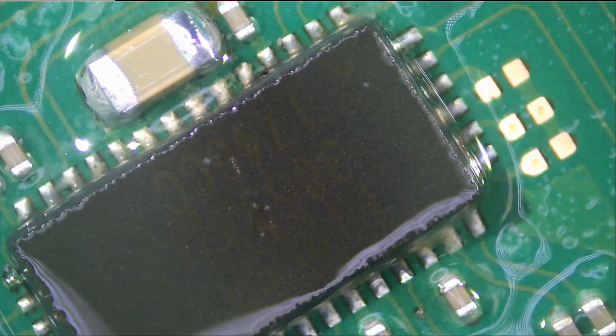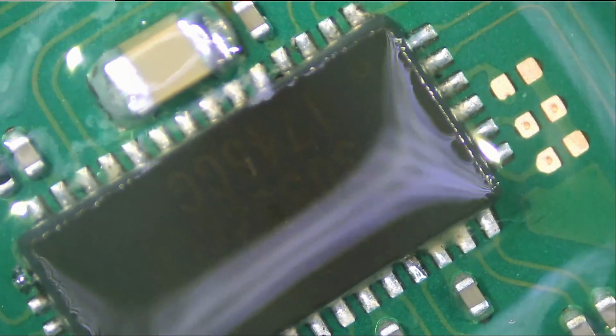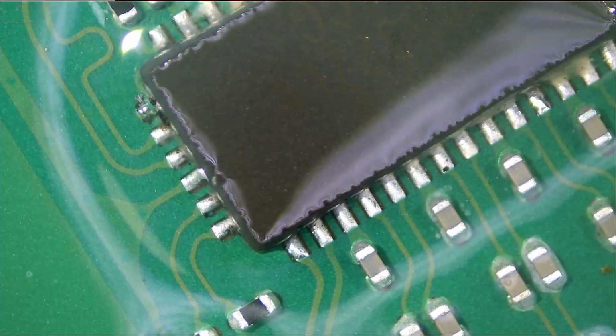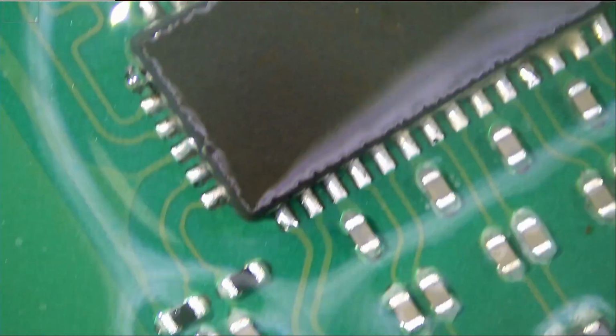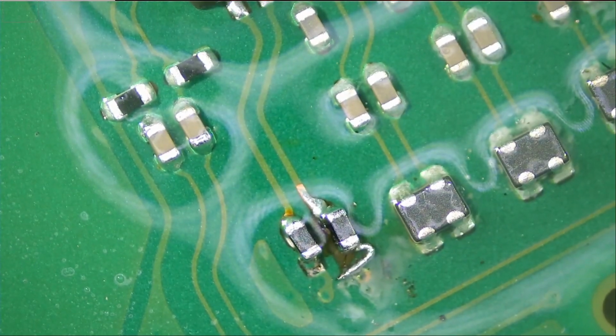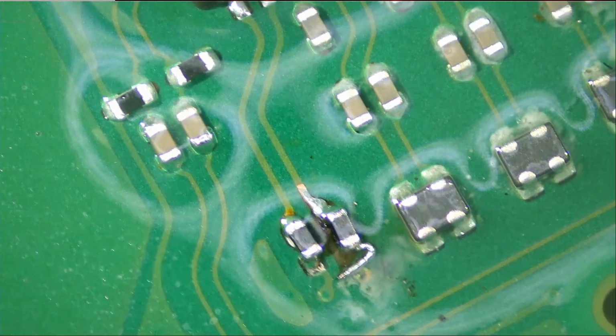Okay, so we're gonna give this to Big Boss to reassemble, and hopefully this Nintendo Switch will work. We fixed the charging circuit by changing the IC and the filter, and now we changed the back chip here, which is responsible for image, and we replaced this big component with 2 filters. Let's give it to Big Boss and we'll see.